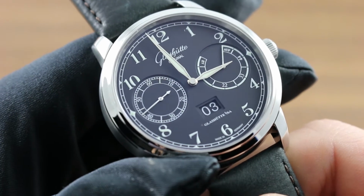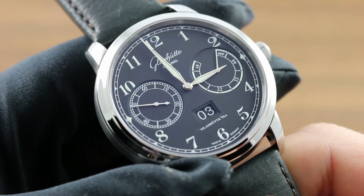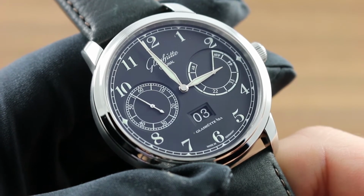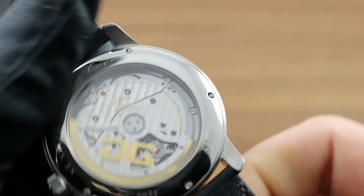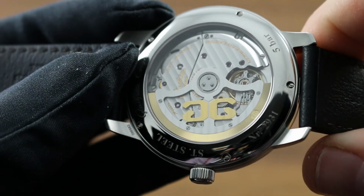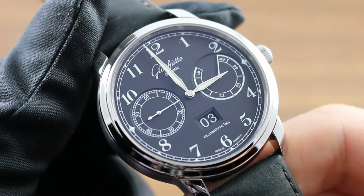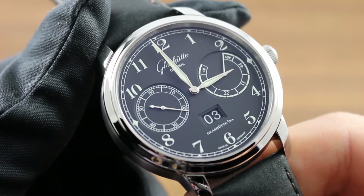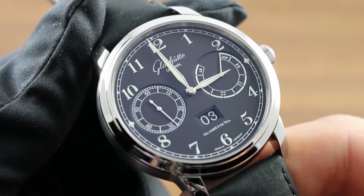It's also important to take magnetism into account because, unlike water, magnetism is the silent killer of a watch's precision. It's also ubiquitous. You'll find magnets in the closures of wallets, purses, refrigerator doors. You'll find them in speakers and subwoofers and MRI equipment. All of these threaten to alter the ferrous hairspring, which is at the center of your watch's beating balance. That's the heartbeat of your timepiece. A magnetized hairspring will cause the watch to run erratically, either very fast, very slow, or alternating between the two. Therefore, if you suspect your watch has become magnetized, take it to a Glashutte Original authorized service center where specialized equipment is available to quickly and easily demagnetize your watch.